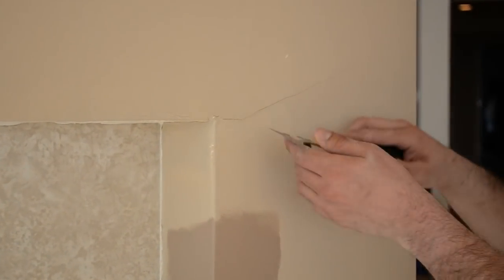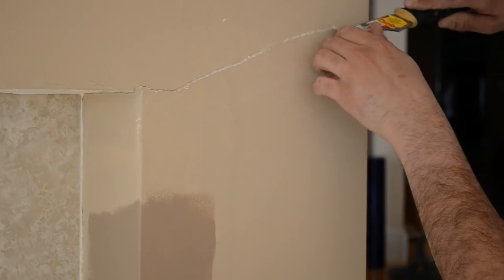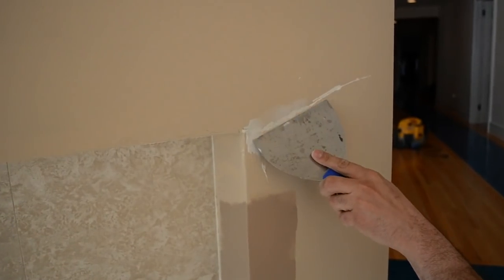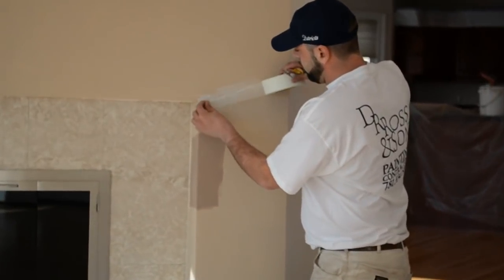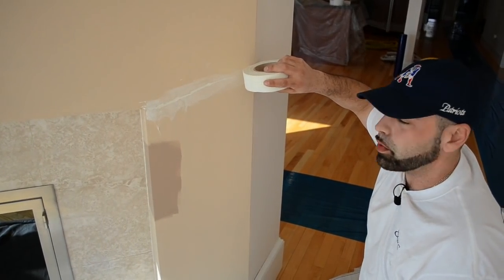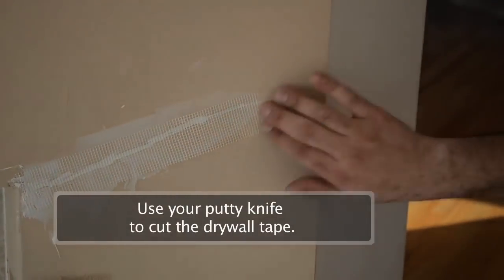You're going to have a lot of these things called stress cracks, just from your house settling. What you need to do when you have a problem like this is take your five-in-one and dig out the crack to give it a little more surface area. Run a light skim coat of joint compound first, then scrape the excess off. You've got your mesh tape — some people call it waffle tape, it's just drywall tape. Now that you've laid out just a thin coat, it helps it stick. A lot of people would use a razor knife to cut it, but then you're risking getting another scar or a cut into the wall. Just grab your putty knife, press down hard and pull — clean cut, no extras, no problems.